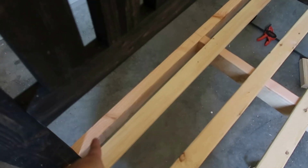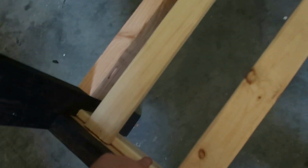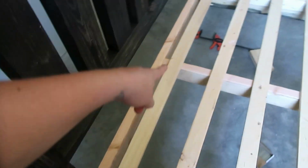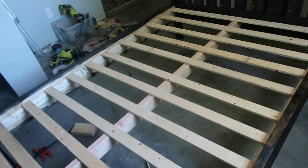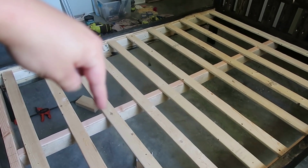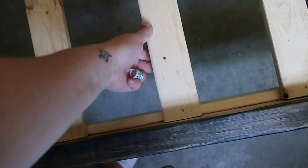Okay. So we just stuck a 2x4 in here where it needed to go as far as matching the height of these 1xs that we stuck in there to hold it. And then I cut these to the length that I measured there, and now it's a super solid bed. Yep. No sagging or anything. And I think that if you had a twin size, it probably wouldn't need this center board, but anything full or above, we could have got away with it probably if we did 2x4s closer together.